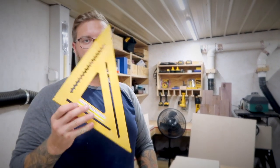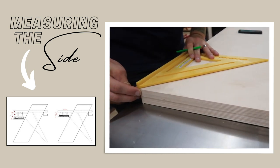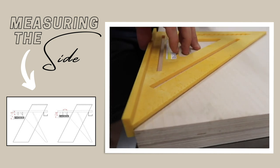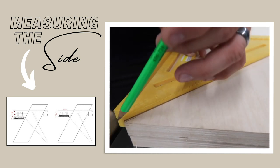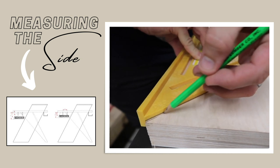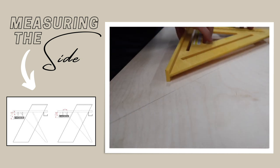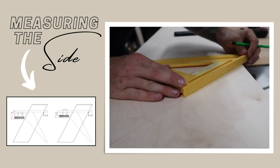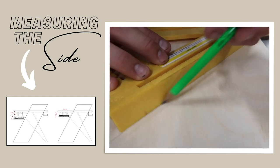All right, so we're gonna use a 1 foot square for this. And we know that the inside corner of a square is 45 degrees. So we're gonna go ahead and do that. So we've got from the starting point, it's gonna be the beginning corner. Let me move this down just a little. And right there, so it's our 45 degree cut, like that. And then we can just finish that mark like so.